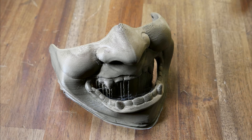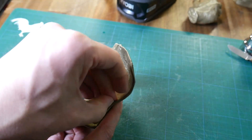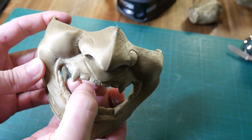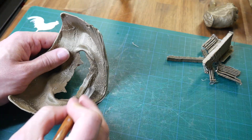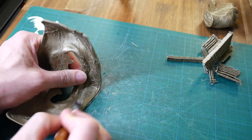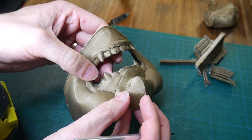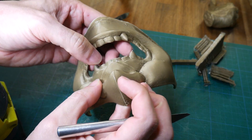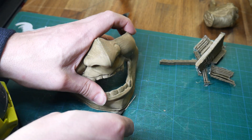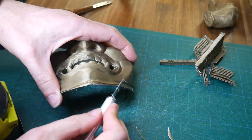Next up was the mask and my aim was to cleanly remove the support and see how much I could reduce the layer lines. The support removal went well — in fact I was able to remove all of it with my bare hands. It doesn't snap away in a crisp fashion like you would expect with PLA. The underside of the front teeth still needed a bit of attention so I continued the post processing. I applied some heat via the heat gun on the inside of the mask which softened things quite a bit, but with this amount of stringing I had trouble removing it cleanly. One thing that did work as advertised was the easy removal of little wisps and strings with the exacto blade. The blade goes cleanly through — it's not stiff like a brittle PLA, it's kind of like a really dense meat, kind of like salami. I was also able to quickly and efficiently trim off imperfections along the front of the chin.